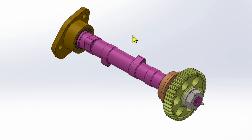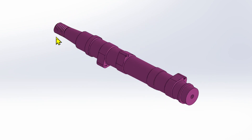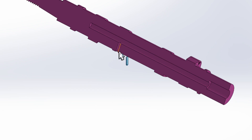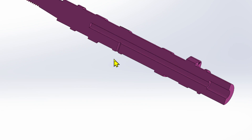Let's take a close-up look at the camshaft itself. This is the front down here — the threaded end — where the gear will fit. I have it oriented like this because I'm going to start machining from this end. I'm going to add a little bit of extra material here so I can grip it in my fixture, add about a half inch, and then thread the end to accept a 10-32 screw. I'll put my pointer here so I can indicate the position of the camshaft in my machining fixture. There is an oil hole that goes down through the middle, and then there are holes drilled in each of the lobes that intersect this oil gallery to deliver pressurized oil to each cam lobe for lubrication.